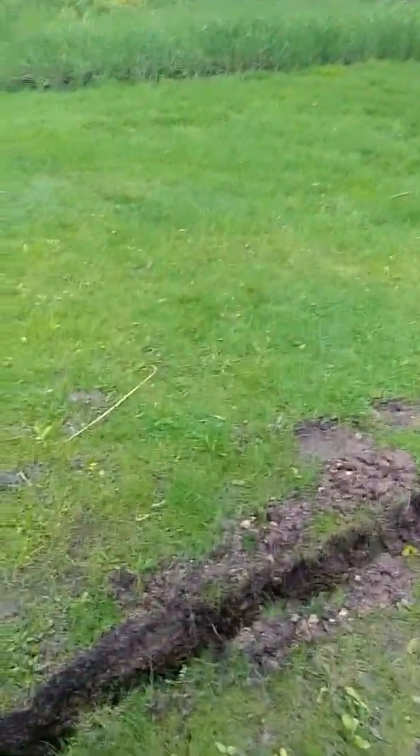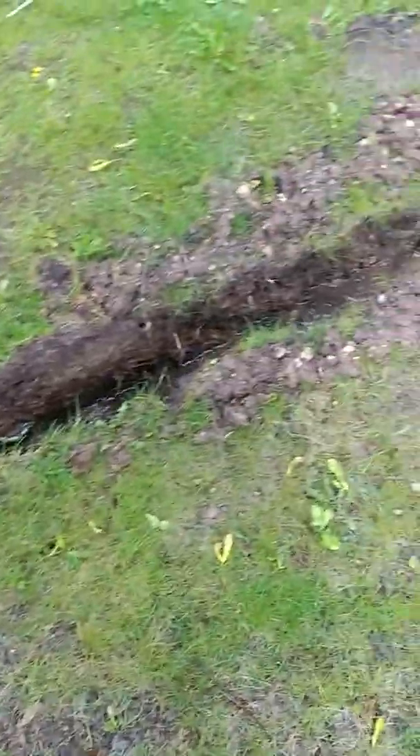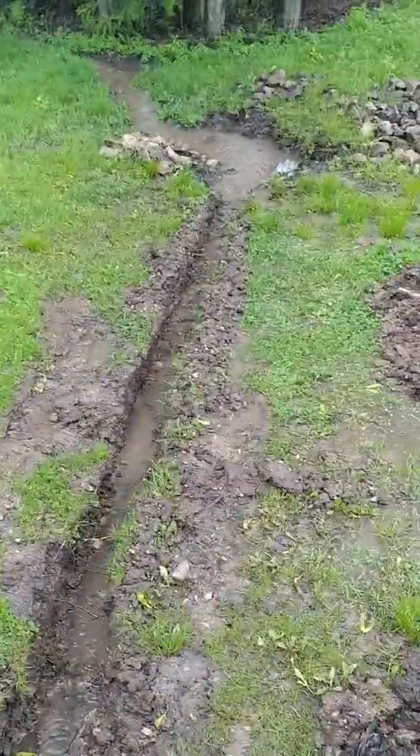So that's the plan — that pit goes right here. I'll also take the top of the pit and put a pipe into this trench here with the downspout, just in case anything freezes or the electricity goes out, so it has a way to empty into this trench and down into the culvert.